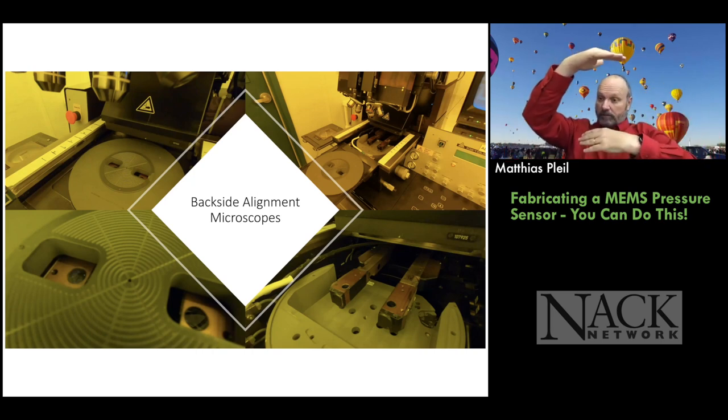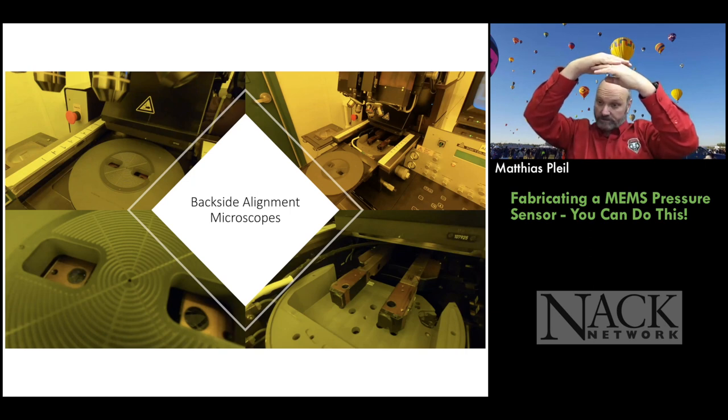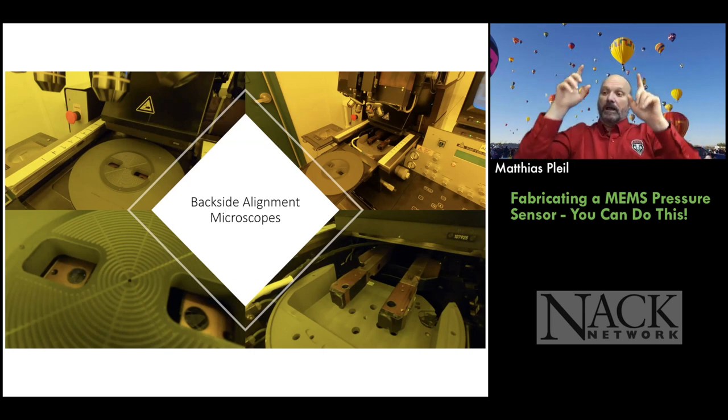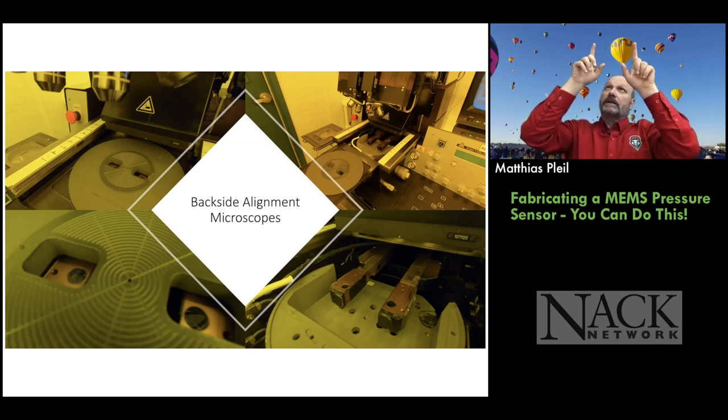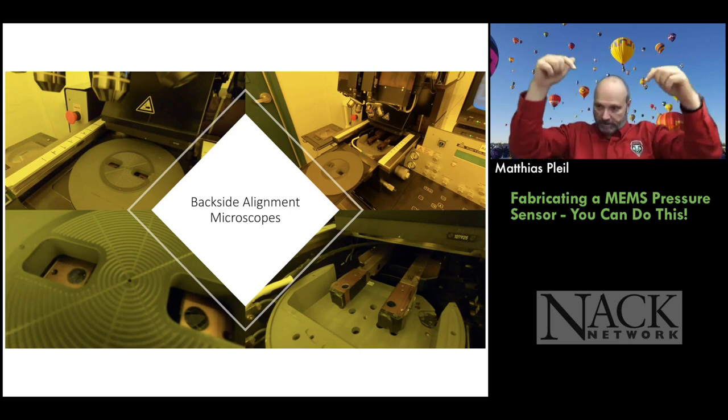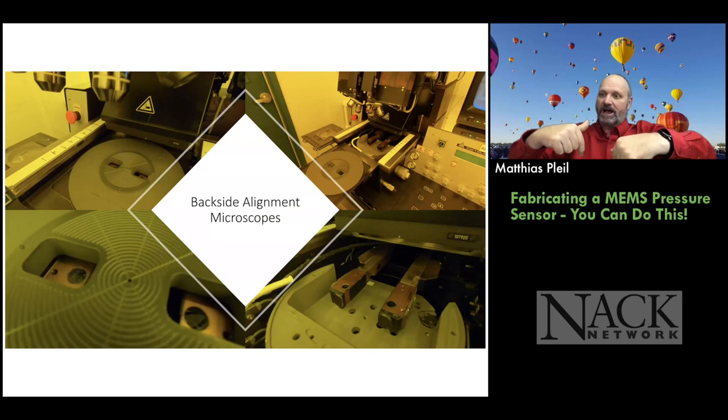And we're going to align a mask to the top of the wafer. So how do you do that? Well, you need to be able to look up from the bottom and find the alignment marks on the back of the wafer and make sure they align with the mask from the top. And this is what's so cool about this tool.